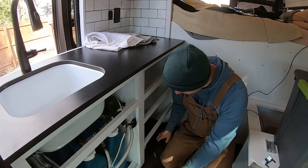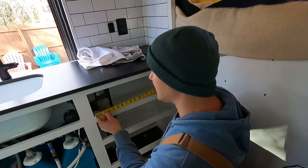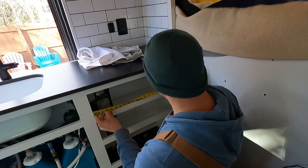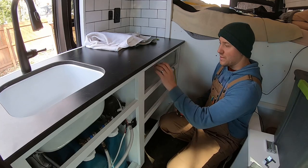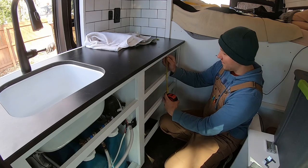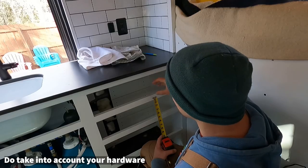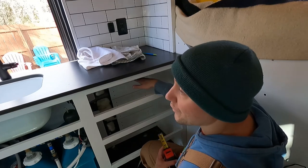We know it's going to be an 18-inch depth. Most slides are a half inch, so especially on face frame cabinets, because the slide is coming out of your face frame, you're going to have to measure out precisely what your opening is and then take off one inch for that. For the opening, because we aren't doing an inset drawer front, the upper measurement is not as critical. You can give a quarter inch or an eighth inch on each side — it just depends on how deep you want the drawer sides to be. You just want to make sure it can fit in the opening without any issues.